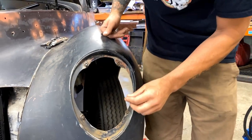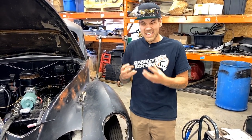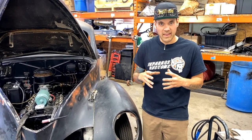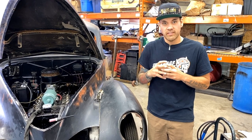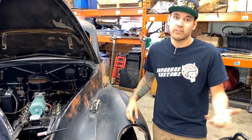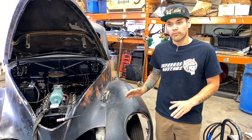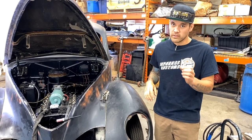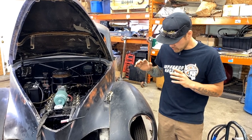What we're going to do is weld a nut onto that stud. The heat from the weld is also going to free up some of that rust — it'll expand the metal and the expansion and contraction of those two metals will break free the rust that has seized the stud. I'm going to show two different ways: one with a MIG welder, since most people have one, and one with a TIG welder, which is very helpful for studs broken off flush — you can build up the stud with it.